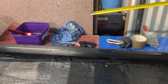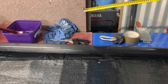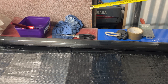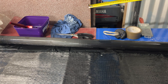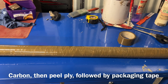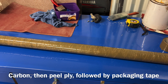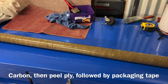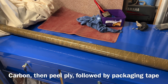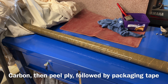I've got resin on the tube and we'll try to roll it on. I can see it's not going well as I'm working on the tube — obviously on my own. It's wrapped in carbon. I tried not to make it too resin rich. Spiral wrapped in peel ply and spiral wrapped in two different directions with packing tape as tight as I can get it.